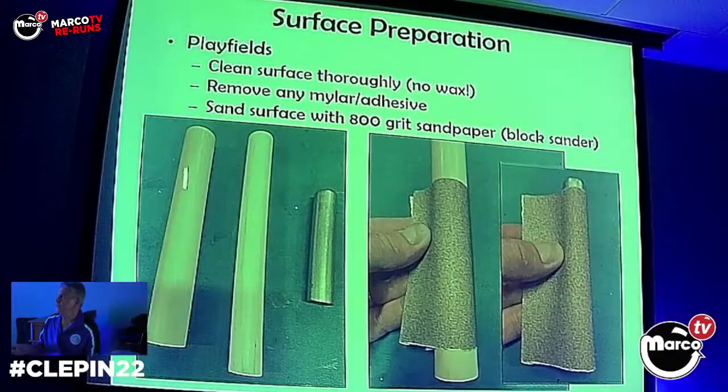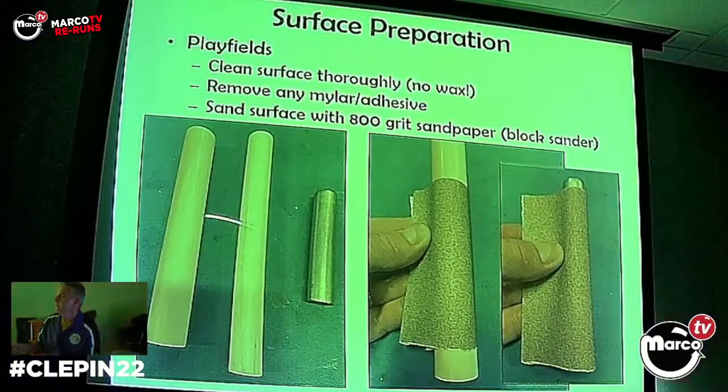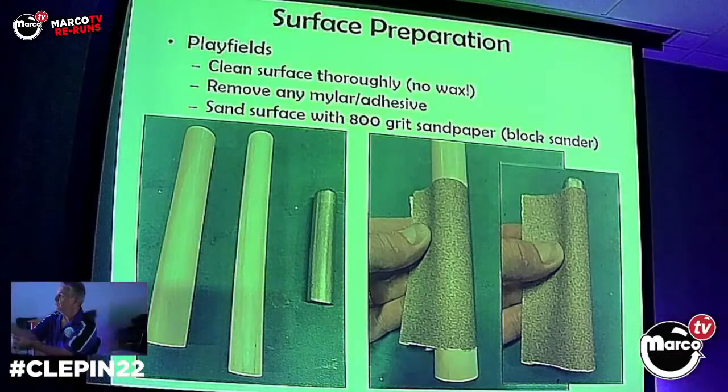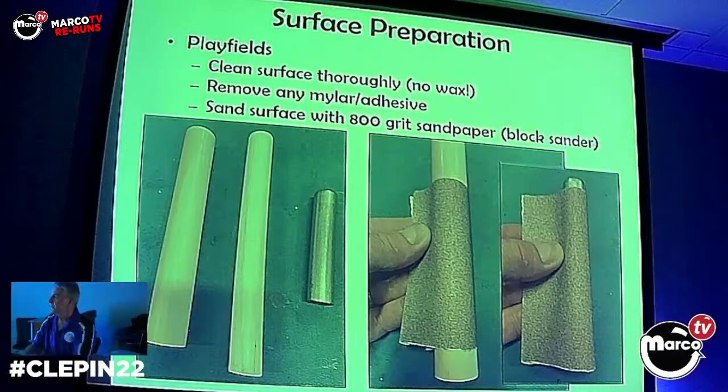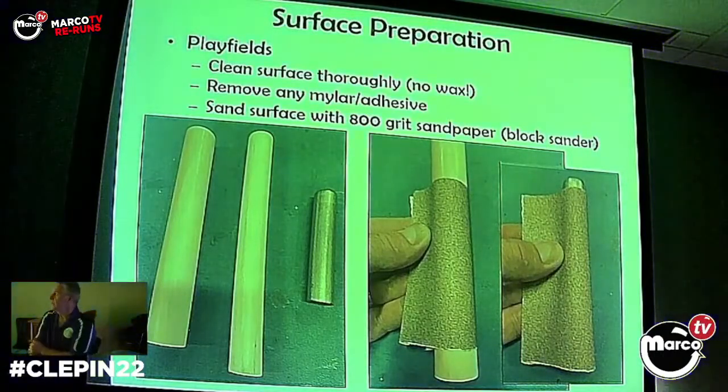For the shooter groove in the shooter lane, I'll use 3/4 or 1/2 inch EMT or PVC, things like that, and just stretch a piece of sandpaper around it, and then just go up and down the shooter groove. As you get closer to the end, you need to use a smaller one and get into the shorter part of the V. You can use this to get some really stubborn black stuff out that ends up accumulating there over time, a lot of times where the ball kicks out and pounds around right at the end of the shooter groove.